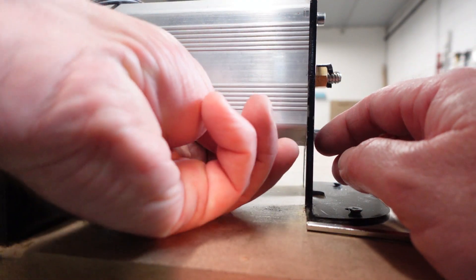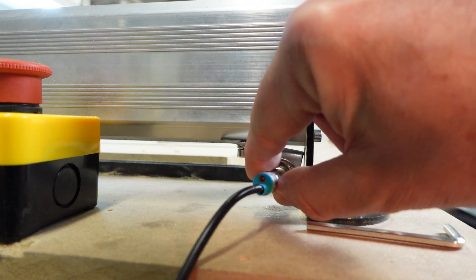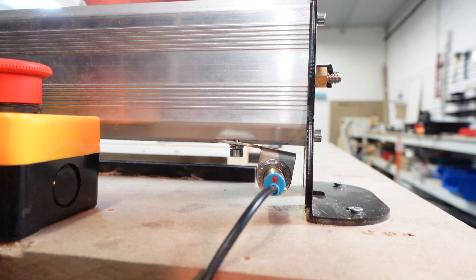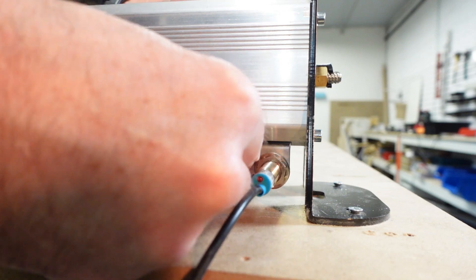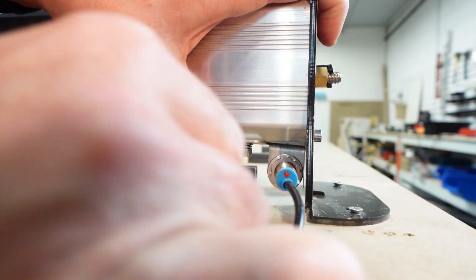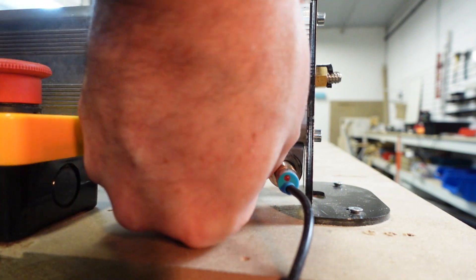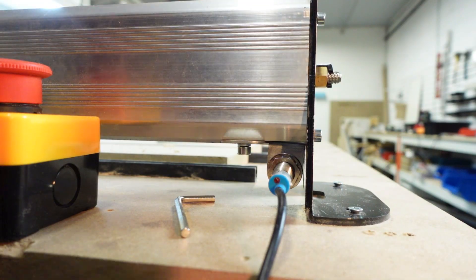Now that that's done, let's put the bracket on. You can slide the bracket onto the nut with the sensor to the right-hand side — this will allow you maximum travel. As you can see there's a lot of flexibility on where you want to place your homing switch. With the supplied allen key you can now tighten up the bolt. Just a quick comment before we move on: don't run the wires through the drag chain for the Z and X axes yet, otherwise if nothing's working correctly you may have to undo all that hard work. In the next step we're going to get everything set up and activated — then you can run them through the drag chain.